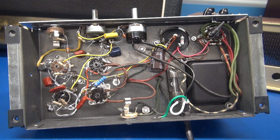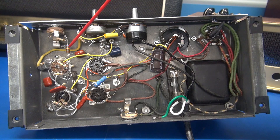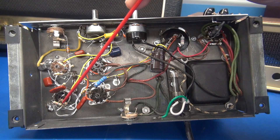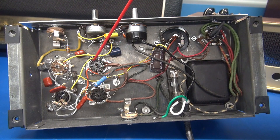Here's our little bottom-side walkthrough of the AO44 modification. This is REV1. I did this same thing about two years ago, and it only featured a single volume control pot, and I also did not modify the chassis to go into a cabinet — that is the difference on this new build. Here is our input jack. The 68K resistor goes direct to pin two of the 12AX7. I've landed a terminal board here to distribute the preamp power between the 12AX7 and the 6AV6. Then we swing over here through these two 0.047 coupling caps, and they are going to the 6BQ5s.